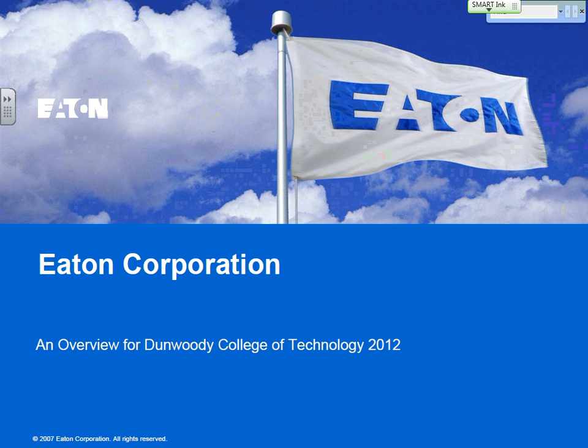You have been coming to Dunwoody now for 6 years, might be eight now. After 8 years, he's familiar with the project that we do, which is a 600 amp, 120/208, 3-phase system, with two panels: a receptacle panel close to 225 amp, and a lighting panel almost the same. So that kind of gives you an idea. We have a generator, so an auto transfer switch, full 600 amp, and no transformers. It's a 120/208 four-wire service. So that's what we have.